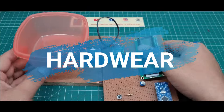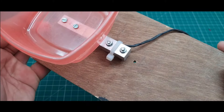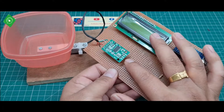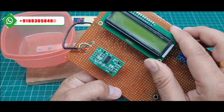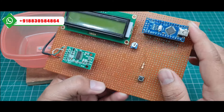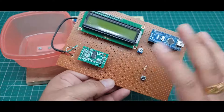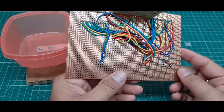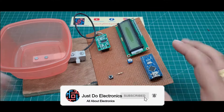So this is the hardware of this project — this load scale. In this hardware, I use this 10 kg load sensor and this HX711 load cell amplifier. I use this 16x2 LCD display and this 10k potentiometer. The microcontroller is the Arduino Nano. I use this 10k resistor for interfacing this push button. I put all these components on the zero PCB and on the back side I just soldered all the components. This is the total hardware of this project.